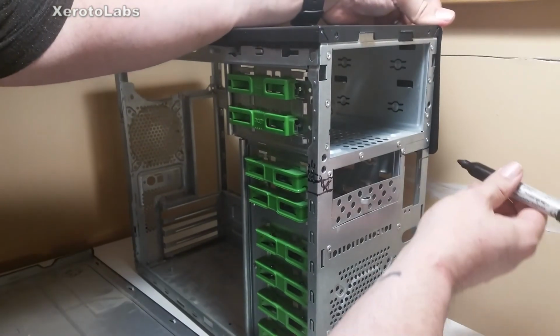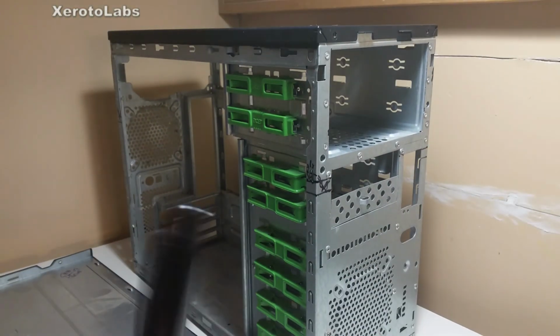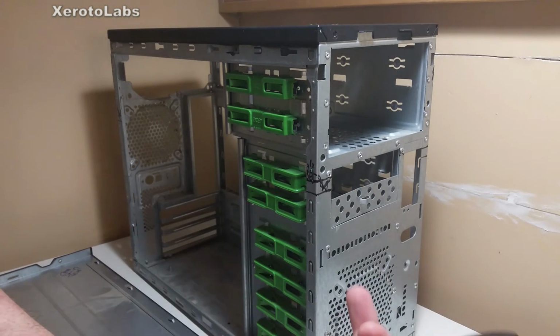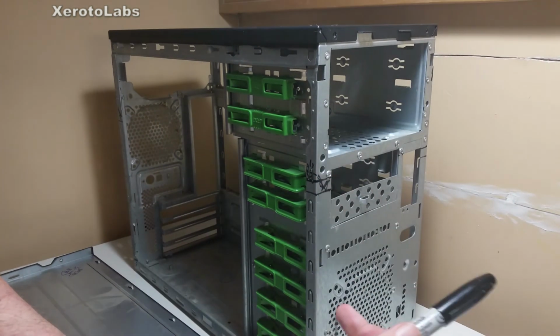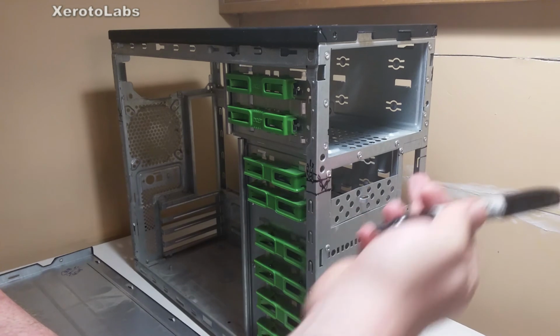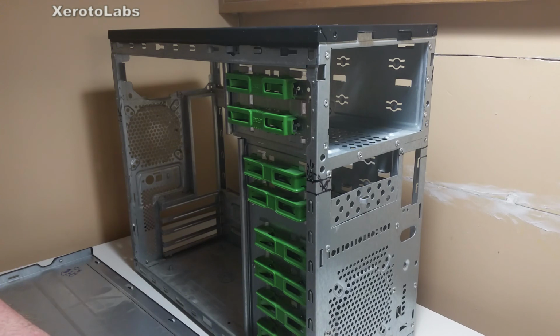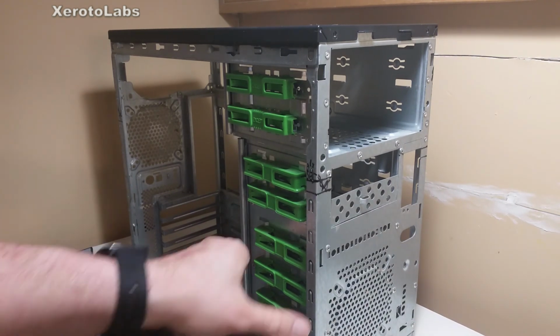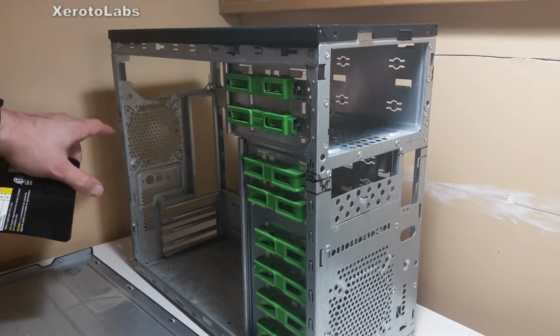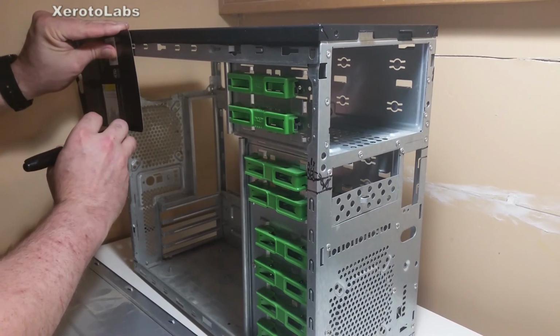When I go around to cut this, I just need to cut that pillar because most of this tall bay that you see here only has a couple of rivets up here, and then a couple on the front here. There's like six here. When I cut this, I want to keep this top part, this bay up here, and then these rivets down here. Once those 4 rivets are taken out, what's left of the front will come right off, and in the back, it's just as simple, just a matter of marking them.